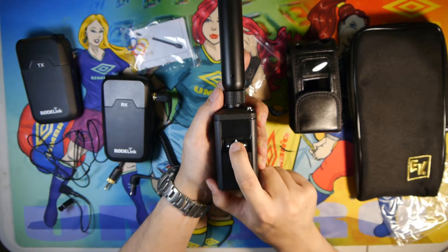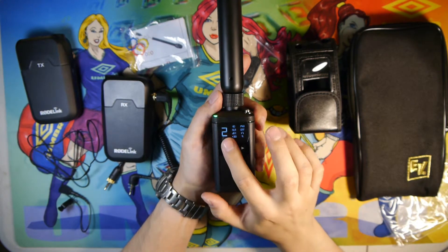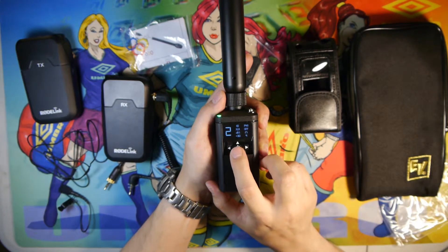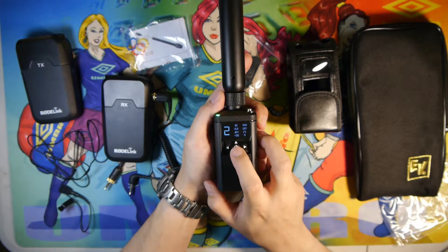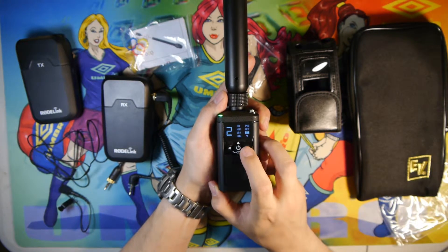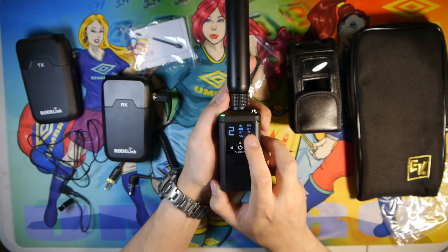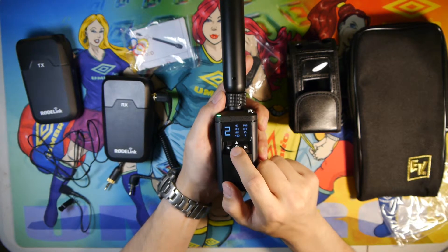I'm going to go ahead and turn this on — you hold down the center button — and it's going to activate my dynamic mic. We have it engaged, and as you can see, I'm already paired up with channel 2. I have a receiver plugged into my mixer on channel 2. These two buttons rotate the options in the menu system; it's a simple select-and-push type-driven menu. Pushing the center button engages the menu selector, where I can select phantom volt power, go to decibel increase or decrease, or adjust my headphone volume. I have it set to 9 out of 11 increase. I can also switch from XLR to TRS here if I want, but I'll disengage that.